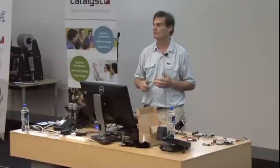The suggestion actually from Paul McKenney was to concentrate on the 30 millisecond times, because they happen a lot more often. And if we can find the cause through the latency analyzer or some other toolkit of the 30 millisecond times, then perhaps that will lead the way to the longer timeout. So apart from that, in the 11 hours, you can see it does actually fly. It actually flies very nicely. It flies just as well on Linux as it does on the dedicated autopilot boards. But just occasionally it could get a long delay.